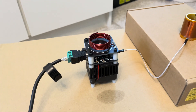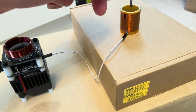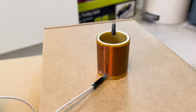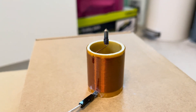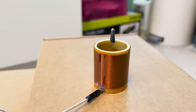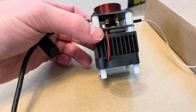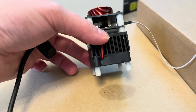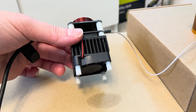What we've got here is basically a primary coil consisting of about six windings and a resonator coil here with about 150 to 200 windings. As we can see, the end of the winding that winds around the electrode has turned black because it got so hot that the enamel just melted off. Inside the unit it's just that circuit board, and the main thing we're interested in is this black MOSFET, which is where all the magic happens — it produces the RF energy at 1.5 megahertz.